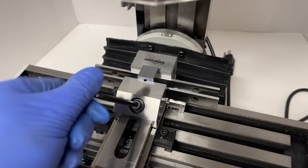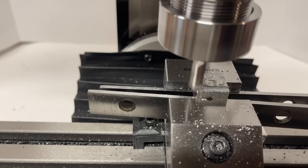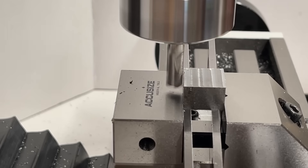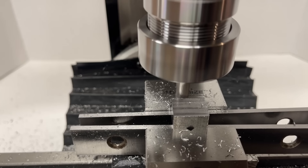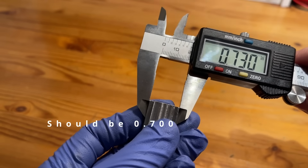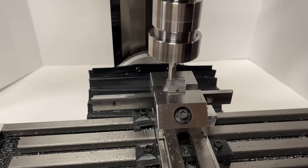Because I don't know exactly how far I can push this mill, I started off with a 20 thou depth of cut just to remove the saw marks. Once I had the saw marks removed, I upped the depth of cut to about 40 thou to bring it to the dimension that we needed, and got similarly good results. I think we should try to cut the side profile without moving the z-axis — about 20 thou width of cut at a time at full depth, conventional milling. I definitely got distracted while filming and completely forgot to mill the sides to the dimension after squaring up the stock. No worries — that can be fixed simply by replacing the part in the vise and cutting off the extra material.